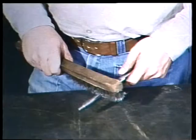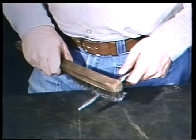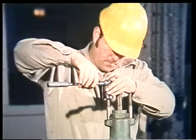With the valve fully disassembled, all threaded surfaces should be cleaned thoroughly. A wire brush can be used for the large stem threads. The bolt and stud threads should be chased with a thread chaser. As we discussed earlier, this will make them easier to reassemble.